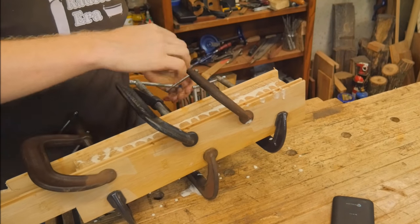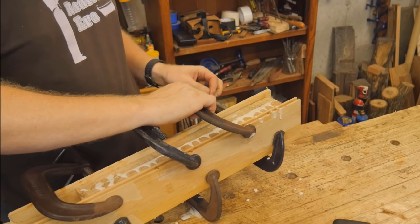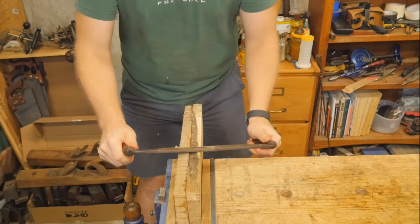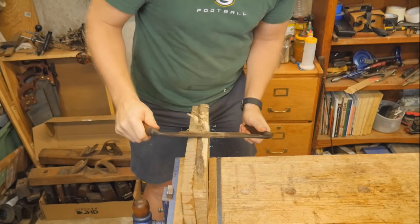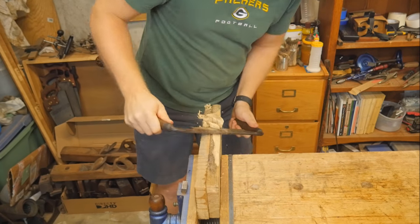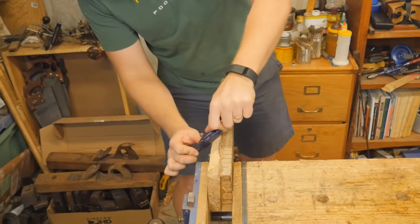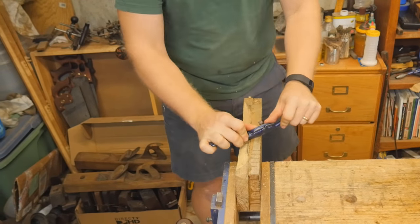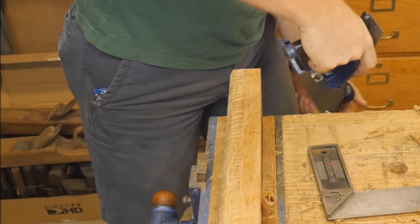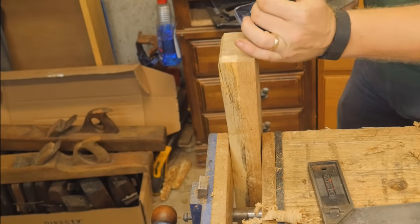C-clamps are great, they get a lot of force, but you need to protect the wood so I have disposable blocks on the other side. Once I have it back into shape I want to do a little bit of sculpting on the body. I didn't want it just to be this large rectangle, so I used a drawknife to take out some on the front side and the bottom and give it a bit of a shape. Then I can come in with the spokeshave and refine that shape and make it a little bit smoother and cleaner. After that I go through and give all the corners a chamfer - the top front gets an extremely heavy chamfer to kind of match the bench, and it also keeps it from chipping off in the future.